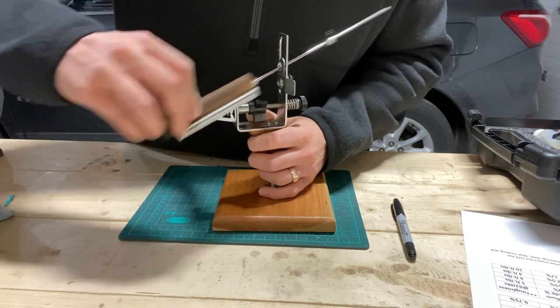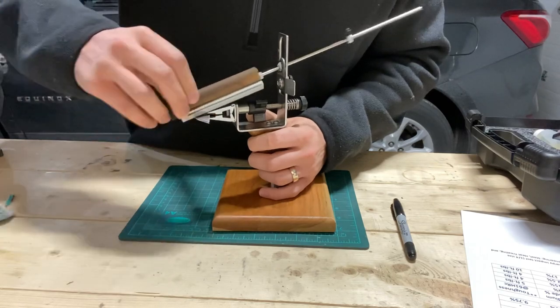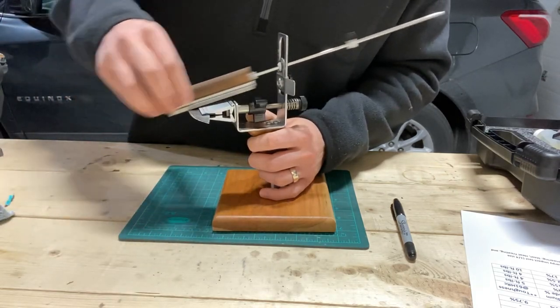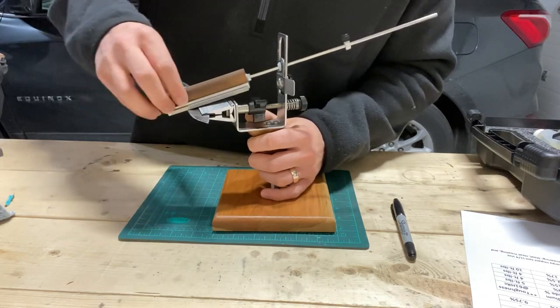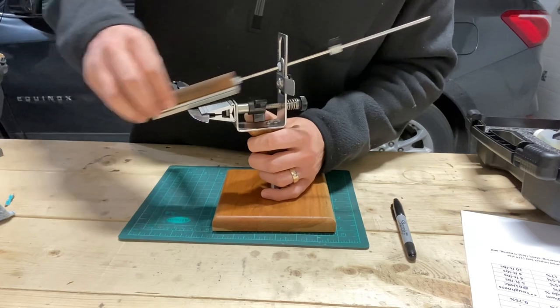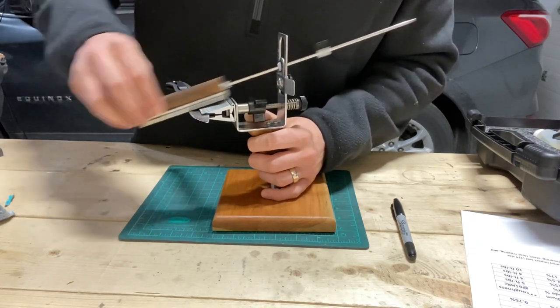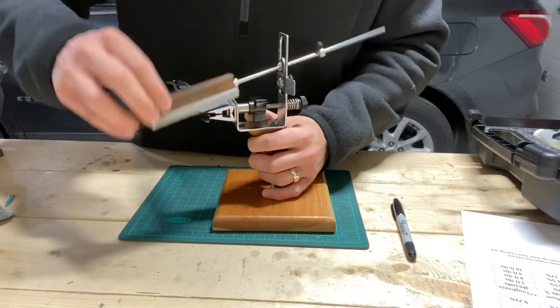And then after the 400, I went to the 800 grit Chocera just to kind of feel the hardness of the steel and the carbide volume. And then the 3K Chocera. The edge that came up on it was fine. That was about 18 to 19 degrees per side, which was lower than what was probably 20 degrees from the factory.